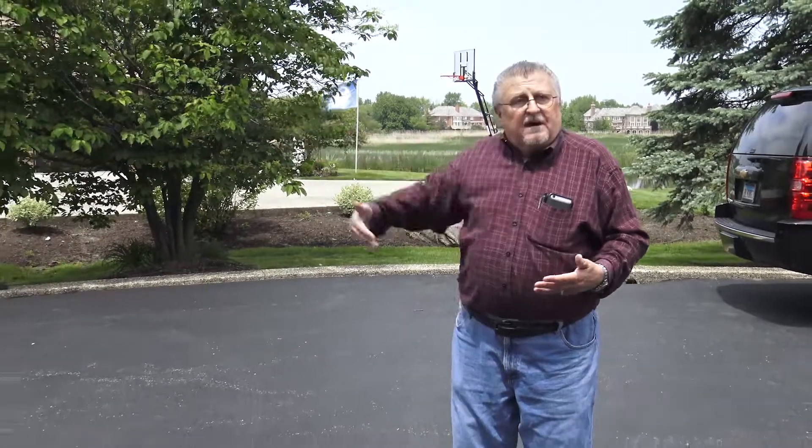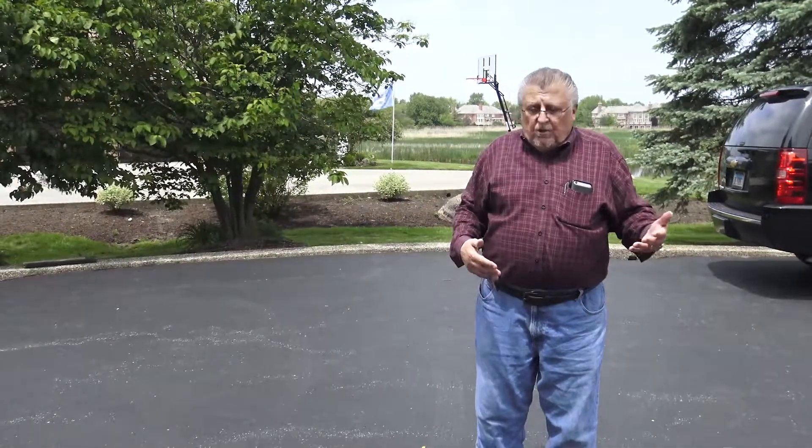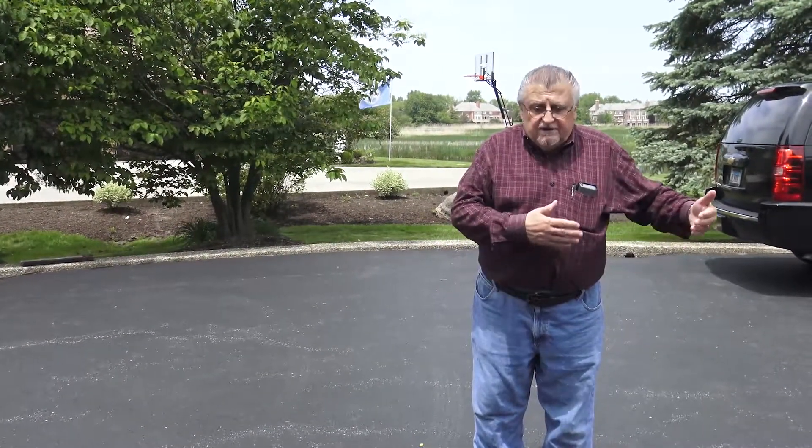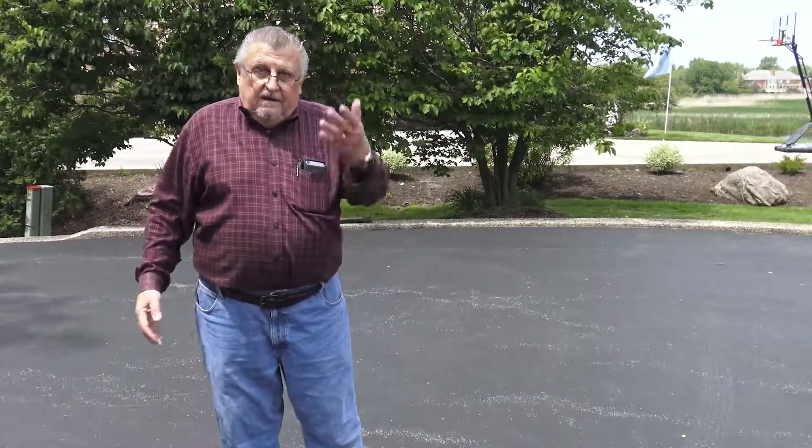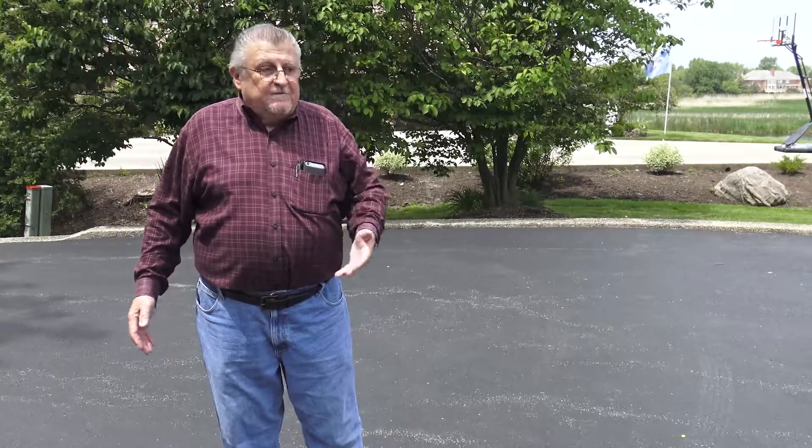I'm out about 20 feet in the middle of my driveway. I don't need it to go any further than this — I want it to catch me as my cars come up the driveway. So what I typically do is walk across the field of view of the PIR like so, and as you can see when I've done that it basically goes off, which means it's catching me at the distance I preset it for.